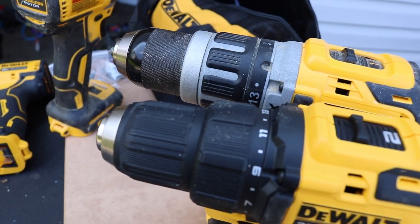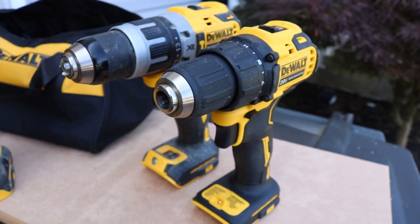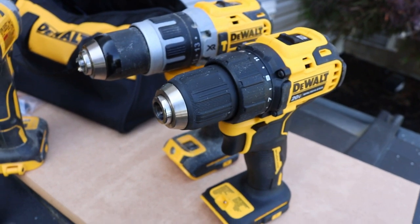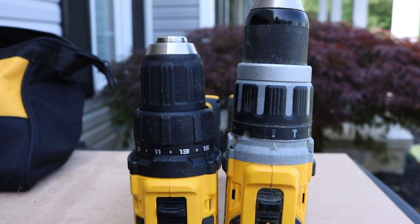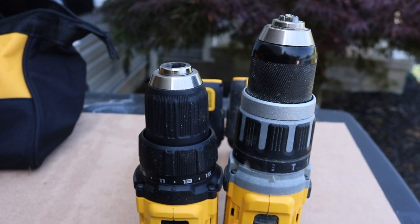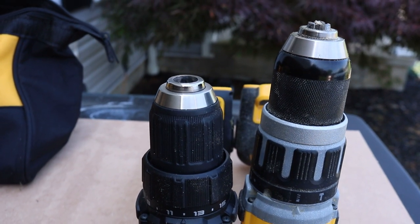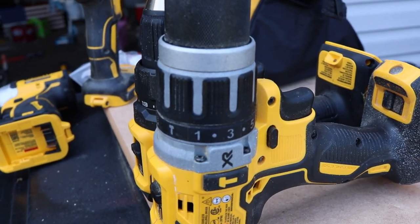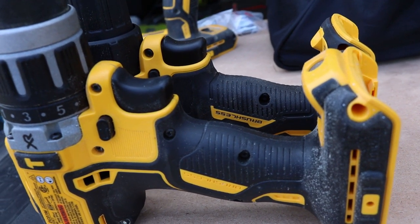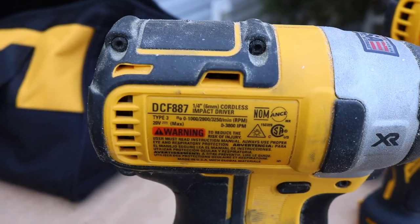Comparing the drill size, the length is a little bit shorter than the older model, though not by much, and the height is basically the same. I'd like to have seen it brought down more in compact size — it's definitely not the smallest compact I've ever seen. At only 6.3 inches long compared to over 8 inches for a larger model at 3.6 pounds, it does save some size. The Atomic runs 1,650 RPM vs 2,000 max on the larger model, which is 50 under the Makita compact drill but $20 cheaper.